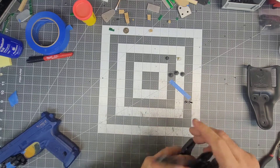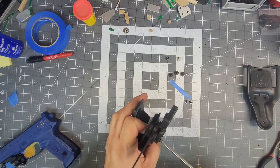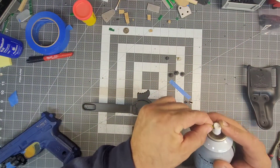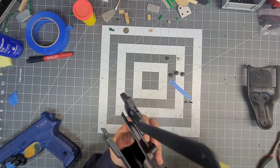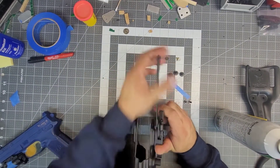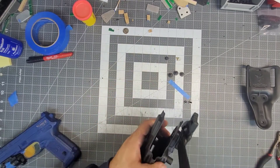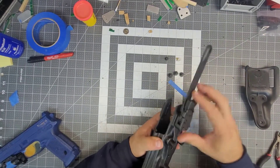That was a little tight. I'll loosen this up — and I wasn't even that tight. That's the only thing that sucks about these: they need to redesign the inside. Where it rotates, I like to lube it up. For you guys out there having issues with your hoods possibly sticking — throw some oil on the rotating joints and it should make a world of a difference. Now I'm making it go directly across, marking it while holding it in place, then drilling that same size you use for your retention. Clean the hole on the outside, then grab the Noga RC2000, clean the inside, take the small hardware that came with it, throw that in, and it's going to bottom out on the screw — that's what you want.